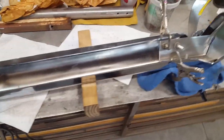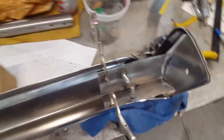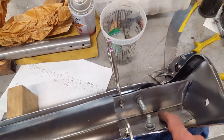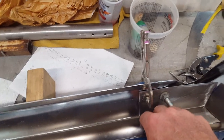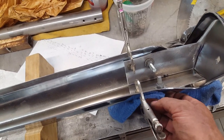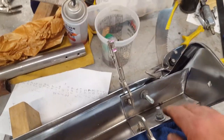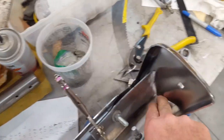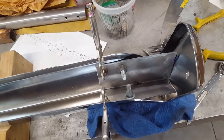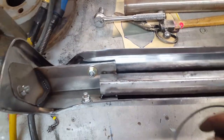I'm having to figure out my own bumper mounting system because this car didn't come with bumper mounts, and even if it did I'd have to modify them quite a bit. I'm going to start with my own bumper substructure. First I'm creating my bolt-up points using 16-gauge steel folded over to fit the contour inside the bumper, drilled through. I clamped it up using a cloth rag on the outside so it didn't mar the chrome, then torqued these down to distort the metal so it complied with the shape — giving me a nice tight fit. Next I'll put a gusset here to pick up this side bolt-up point, do the same for the other side, and also have a pickup point here.